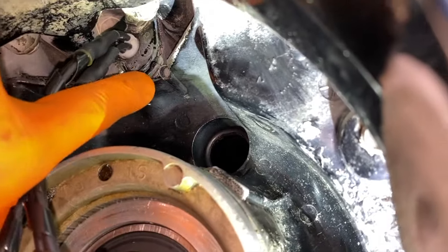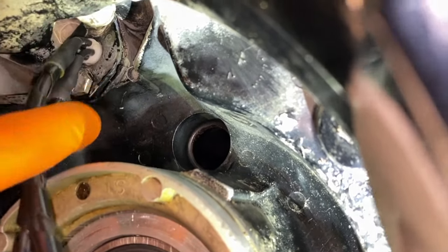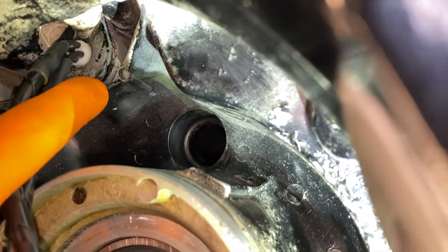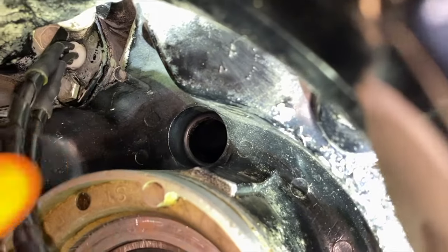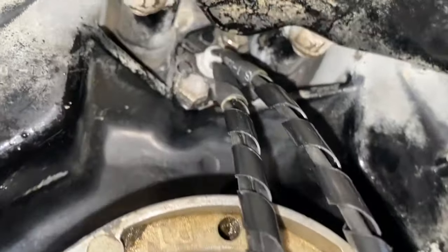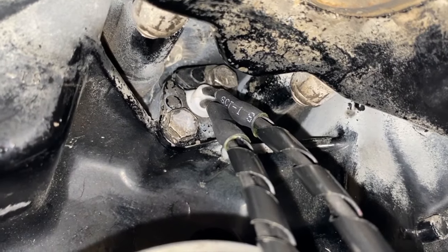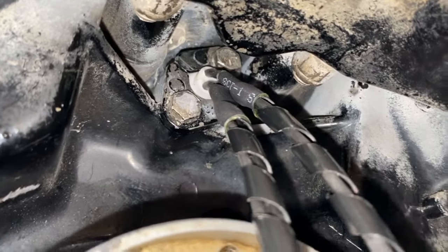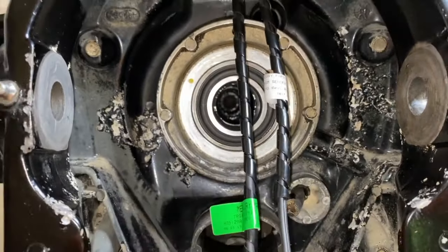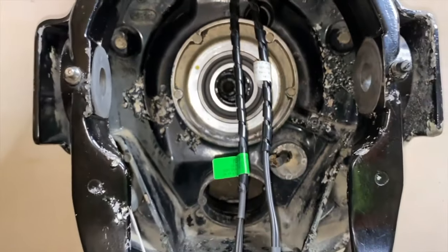There is a gap between the cover plate and transom and it's getting tough because of tension on those inner two halves. As you tighten the bolts, do them in sequence — maybe three to five turns on the top one, come down to the bottom one three to five turns — that will help properly center the two halves as you secure the plate and create that watertight seal. It took me every bit of 30 to 40 minutes to secure both bolts — 7/16 in our case — ultimately securing that plate and pushing those two halves in place. You can see braided wire which will go inside the transom and bell housing area to protect the wiring as the outdrive trims up and down.